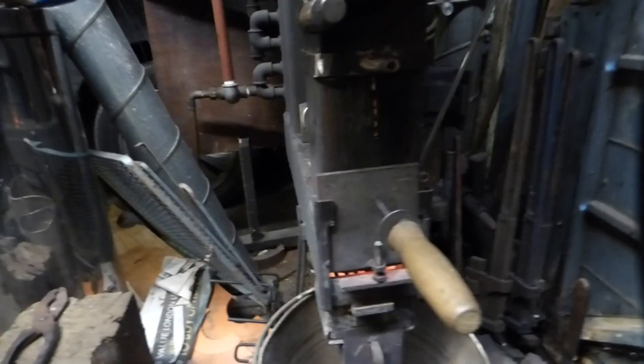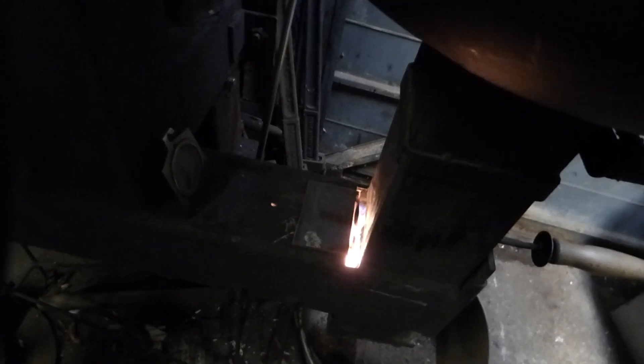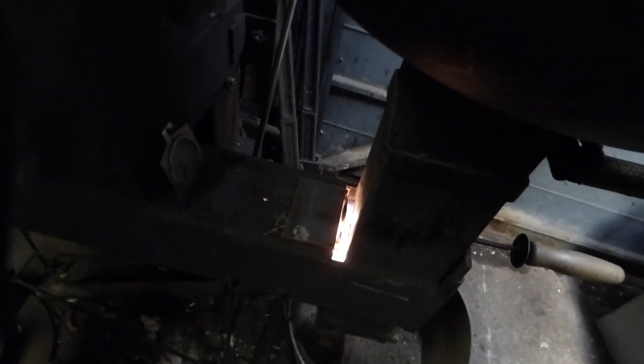Today outside it is zero degrees. I've just checked - the temperature is zero outside and it's up past 11 here inside. Looking in the slot, you can see the flame is quite lazy, but you can still see a little bit of blue there. That means it's burning quite nicely. The slot is open and that's what it's all about. If you don't have that slot it will burn dirty, but it burns quite nice with the slot.